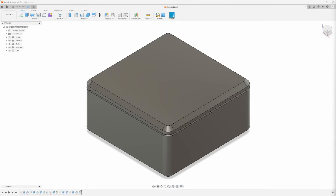Now we can start moving into a proper design. We know that our tolerance is going to be 6.2mm by 2.5mm and we can apply that to an actual model. What I've designed here is a simple little jewelry box — it's a small one so it won't take too long to print, but it's going to use what we know so far. All I've done is designed a base and a top lid. This isn't really a tutorial on how to model in Fusion 360 — it's more about how to apply this embedded magnet technique into your prints.